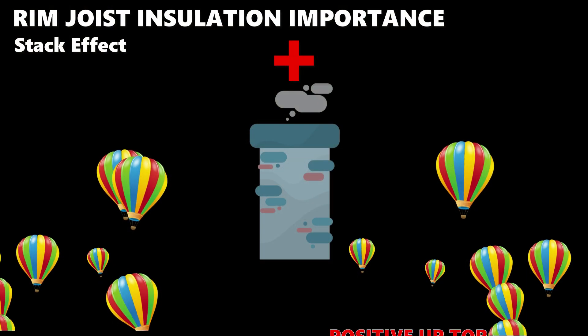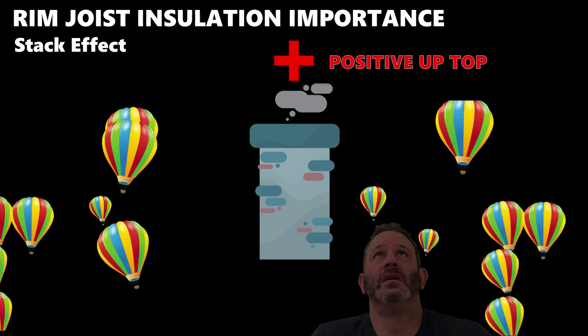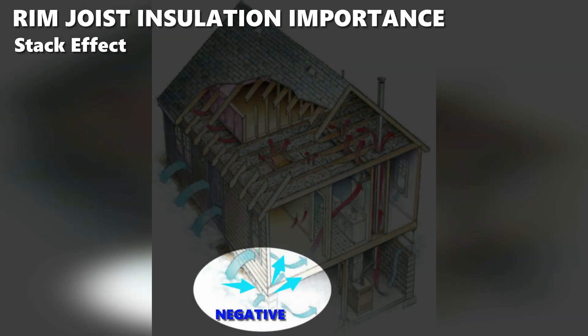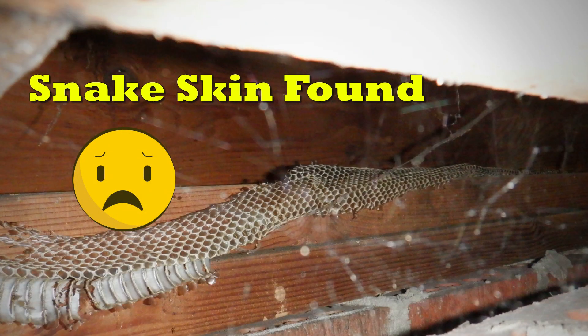Pressure around a house can drive air through the rim joist, and if it's not properly sealed it's definitely going to be a source of high humidity and moisture in the summer, cold air in the winter. You're going to get pests all year round, and it's going to be a source of dust and dirt.